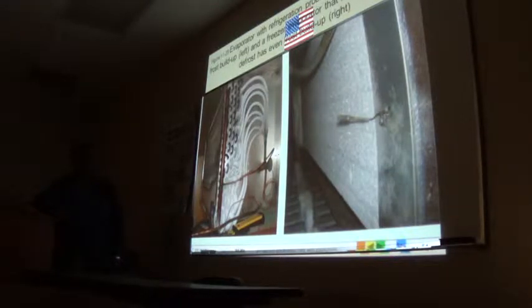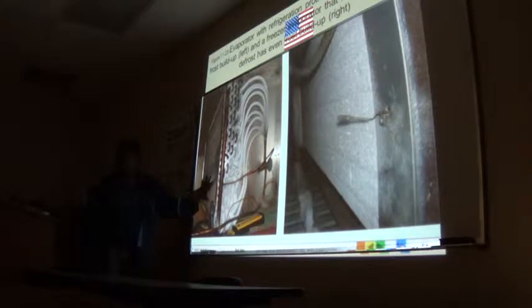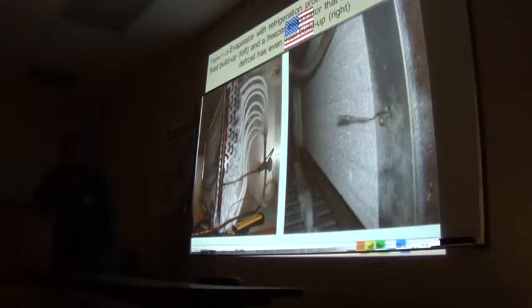Because while the system is under refrigeration, this coil is always wet. This freezer coil is the only one that's dry. If that's wet, then you're not getting enough refrigeration for your box. That always has to be dry. Freezers basically will dry out anything. No humidity.